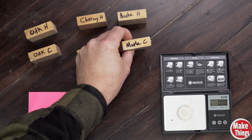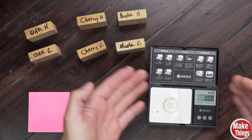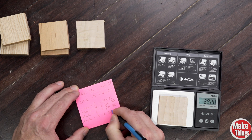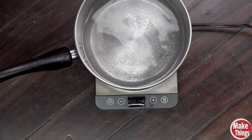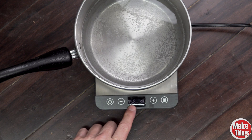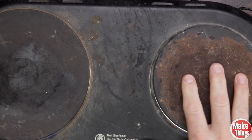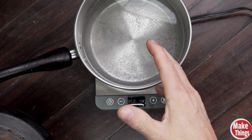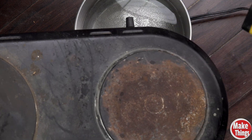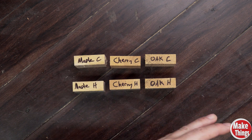With the glue dried, I'm marking the glued end grain so I can keep track of each sample. I've also got a scale here that measures down to a centigram — that's one-hundredth of a gram — so I'll record the base weights before we begin. After spending more time than I'd like to admit playing with this coffee mug warmer, I realize it's just not going to cut it: it's only reaching 85°F when set to 158°F. So I'm switching over to a heating pad I've used in the past for steam bending. My target temperature is 130°F, and with a thermometer I can dial it in manually. With the samples now carefully weighed and the water at 130°F, we're ready.